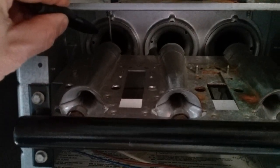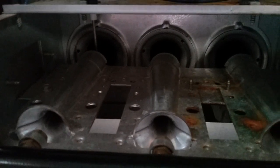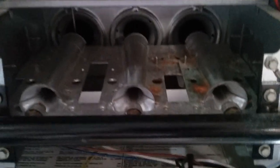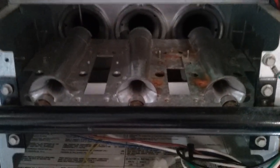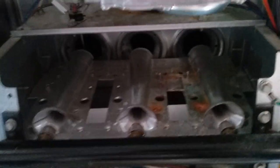We do have a flame sensor behind this burner right here. I can't stress how important it is to keep that flame sensor clean. They do get dirty after a while, and that could cause them not to work — and that's the only thing that detects whether your burners have ignited. If it gets dirty and no longer works, the whole system will just shut down. That'll probably happen on the coldest night of the year, and in a panic you'll wake up and call a technician who's going to charge you a small fortune to come out in the middle of the night.